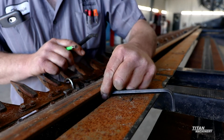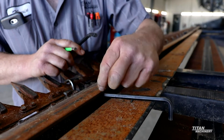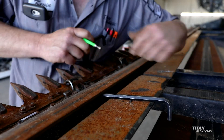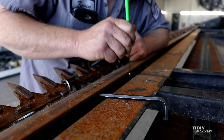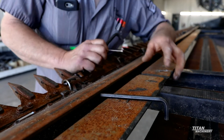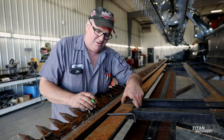If they're too low, you'd be able to move this back end. If it was laying flat, there'd be room back here to move - that would be too low. The deck plate needs to come up and they're adjusted accordingly. It takes a three-quarter inch wrench to loosen the clip that holds the deck plate and you can slide it up and down as needed. You want to start out on the outside of the head and work your way to the center.